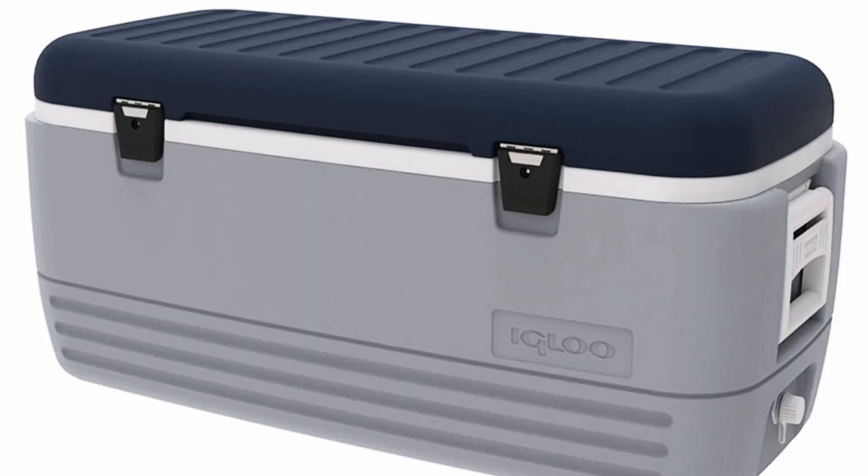What do you do over the winter months with your e-bike battery if you're not using it? Get your battery charged down to about 50% and then store it. I store mine in cool boxes because I have multiple batteries not being ridden for two or three months and I need to make sure they don't get frozen overnight. E-bike batteries don't like super low or super high temperatures — there's a medium range where they give their best performance.